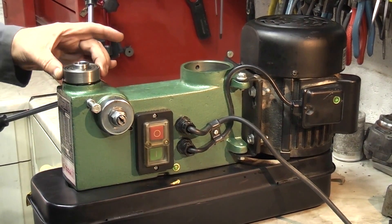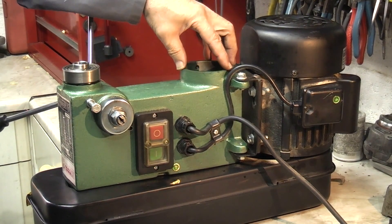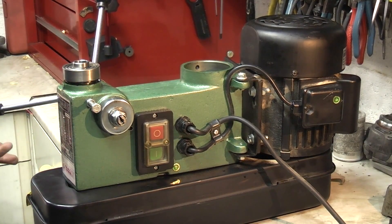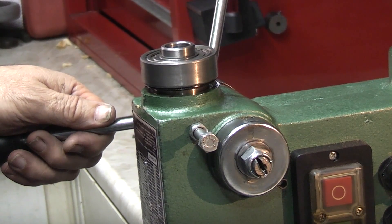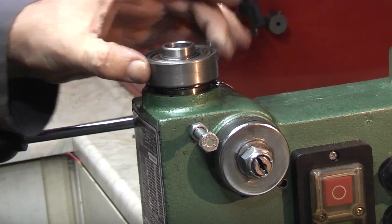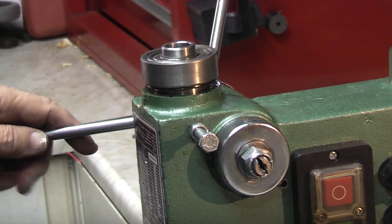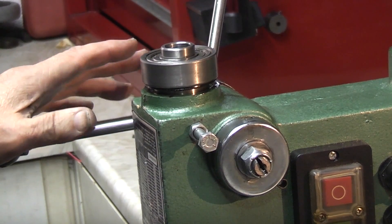This is the spindle of the drill press, motor at the back. This hole here is where the column of the drill press goes. It's upside down which is easier to dismantle this way. With drill presses as they get old, you'll notice that when you drill with a centre drill you can see the centre drill trying to move around and find the centre. When that starts to happen you know that the bore in the casting has got larger. So I've been trying to think of a way of tightening up on that so it's more accurate.